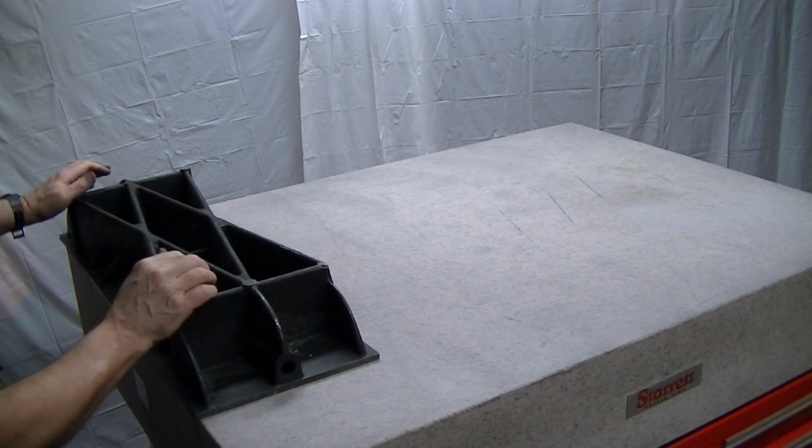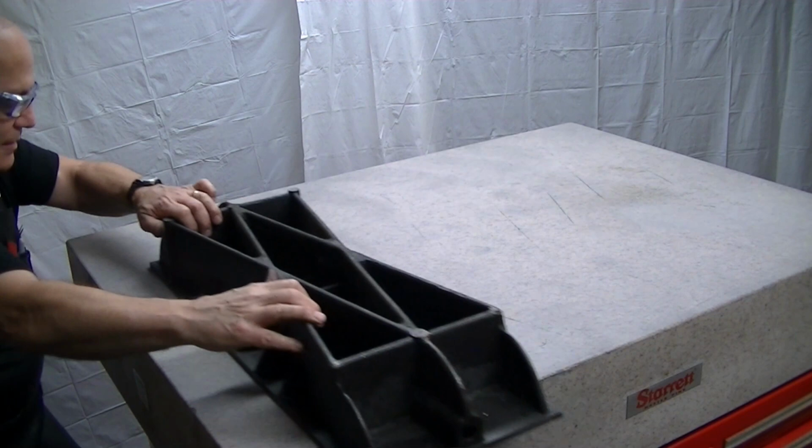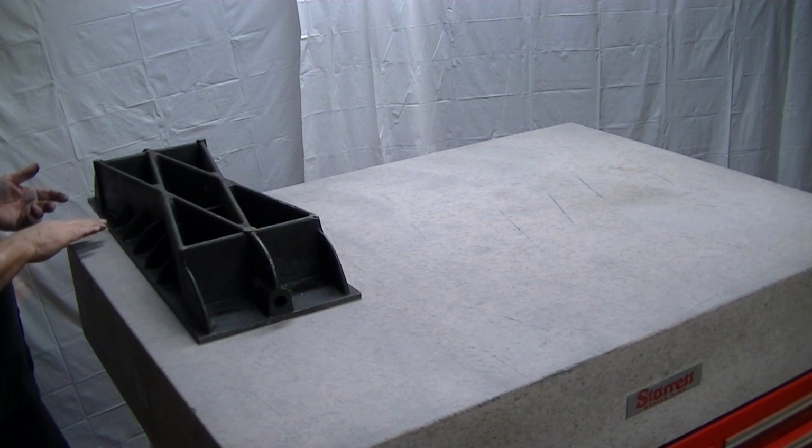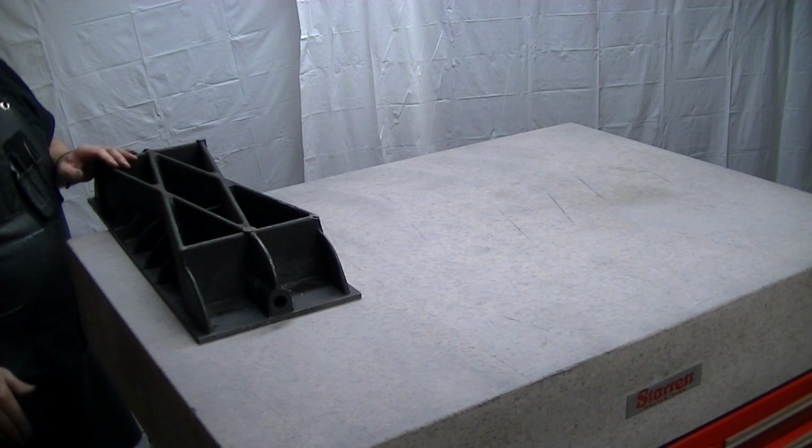One technique, as you use this and you skate off the ends, in the middle preferentially, since when this comes off here, this isn't working, this still is. Same way on this side. This isn't working, this is. You're preferentially going to wear this plate to be concave. As in all lapping, upper plate's going to get concave, lower plate's going to get convex.